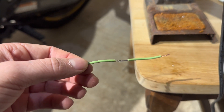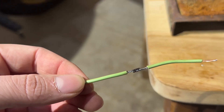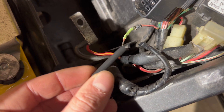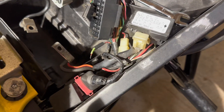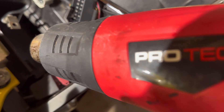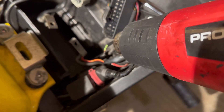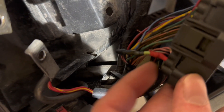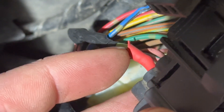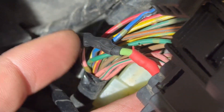Now I've got the little extender on, we just got to throw on a piece of heat sleeving. Got that on, hit it with the heat gun for a couple seconds, get that all sleeved up nice. There's a little addition added. I can't get the little rubber gasket thing back in there, so I just made sure that this was in there enough — it'll be fine.